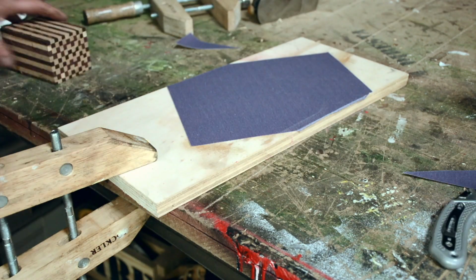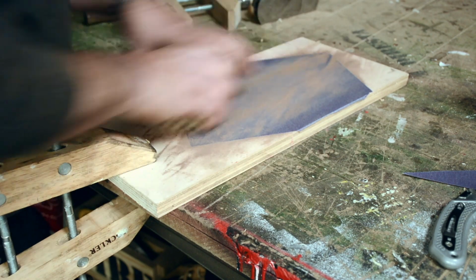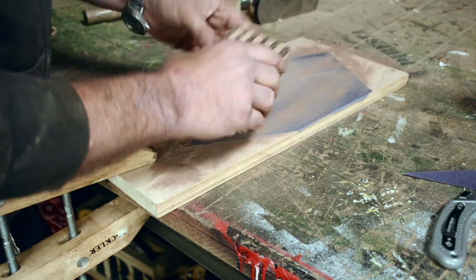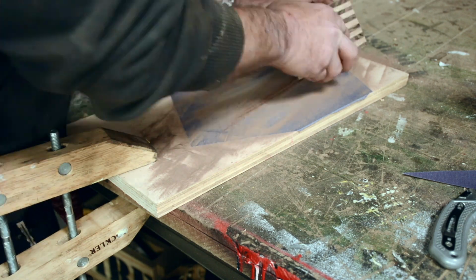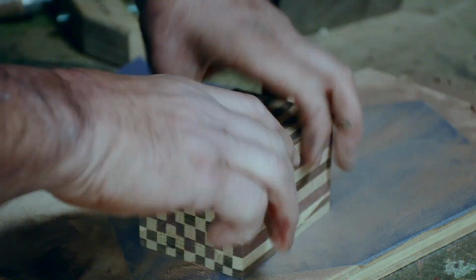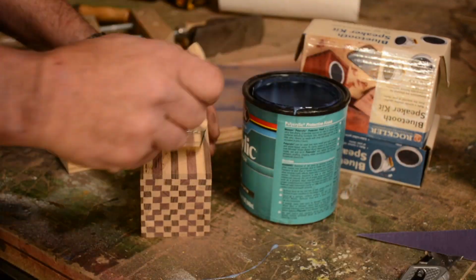And I'm just using a little piece of flat wood, and the reason I put the sandpaper at a diagonal like that is because you get the longest stroke from corner to corner, and the other advantage is that you don't grab the paper as easily. If that piece of square wood ran across the square edge of the paper, you're likely to rip it and tear it. By having it approach the edge of the wood at an angle and the paper at an angle, the paper doesn't get caught up and peeled up. So try that next time you do that. Hit it at an angle.